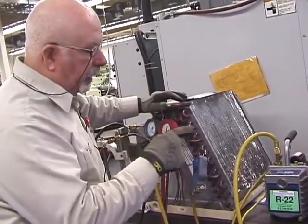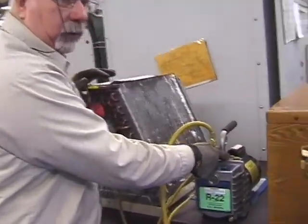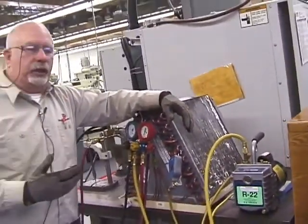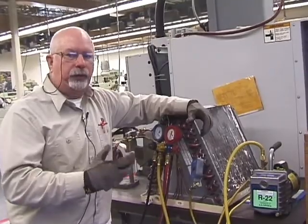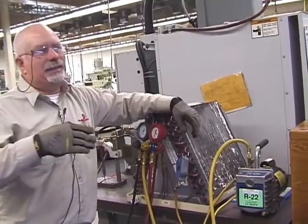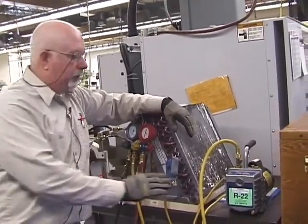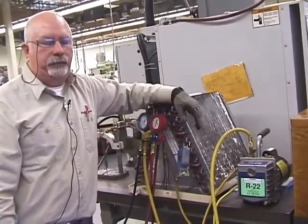But before you start that vacuum pump, the very first thing you have to do is open up that ballast valve. Open it up about 2, 3, 4 turns. All right? Think of it this way. When you start something and it's under pressure, it takes a lot more thrust to do that. All right? And a lot more wear and tear on the unit. The book says open it up and let it stay open until you get like 1,000 microns. Don't worry about that. All we're worried about is trying to help the compressor. So you keep that open. That's the very first thing you do.